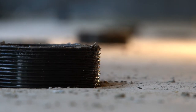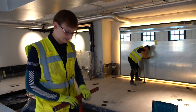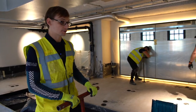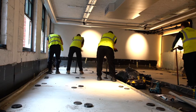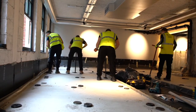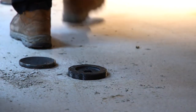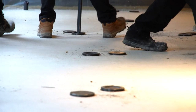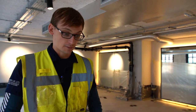We are in the process of lifting the floor. We use these sophisticated waist-high T-wrench screwdrivers. Essentially we go around across the floor, put them in the hole, and do two full turns to apply approximately six millimetres of compression. We do that process across the whole floor for approximately ten times, then we'll survey and find our final level. By the time we finish that process we'll have an approximately 50mm lift.